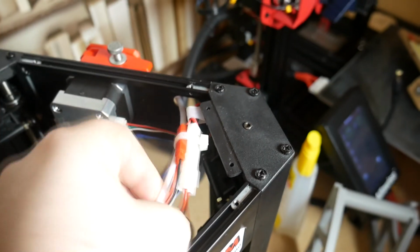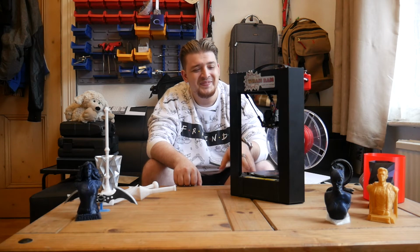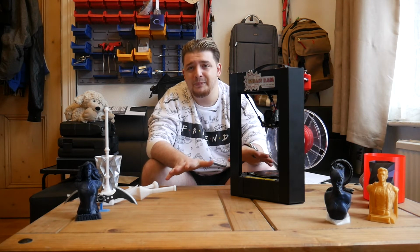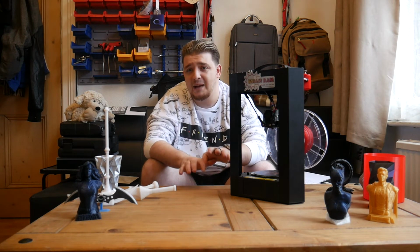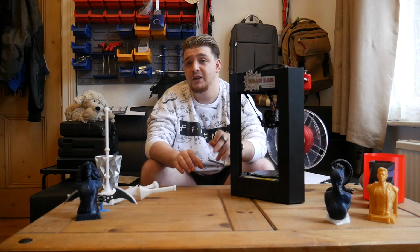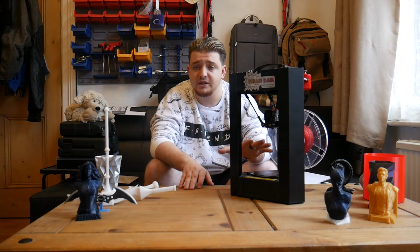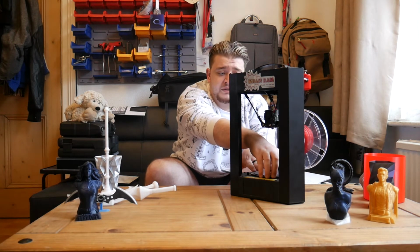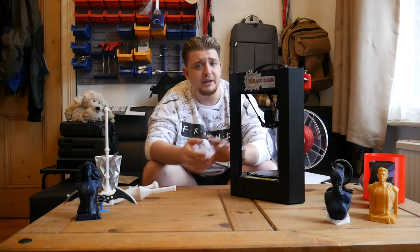And I just happened to look at the screen when it said 543 degrees on the hot end. I didn't think that was right. But it didn't stop. And it was there for about 15 seconds whilst I was looking at it and nothing happened. I don't know if I just caught it or it had been there for a while, but the fact that it hadn't triggered thermal protection was seriously upsetting to me. As a printer that is so often touted as being for the beginner, for the learner, for the kids, that's a big no-go to me.